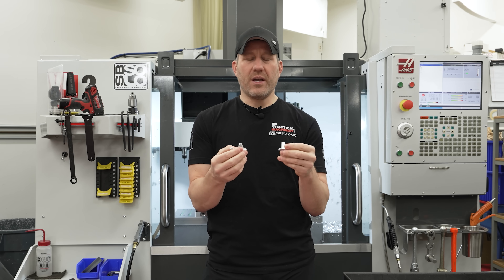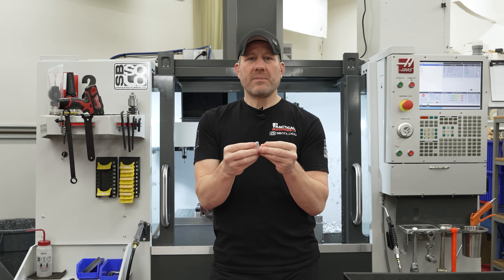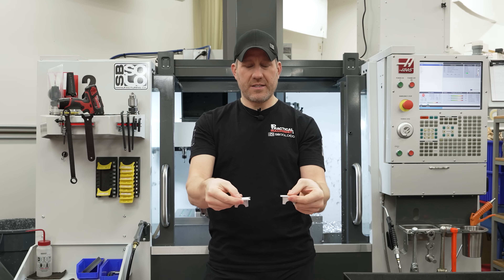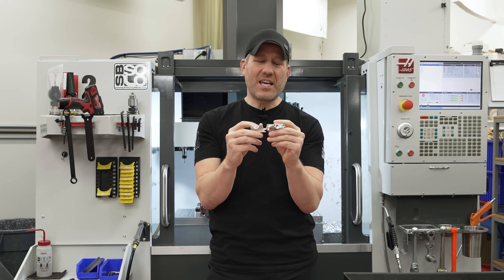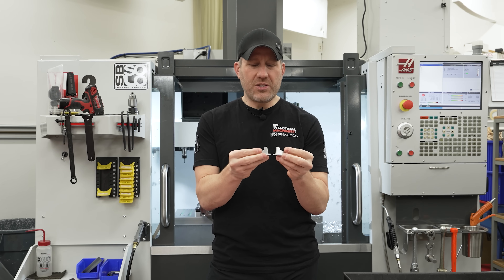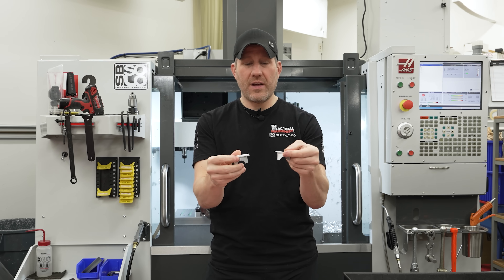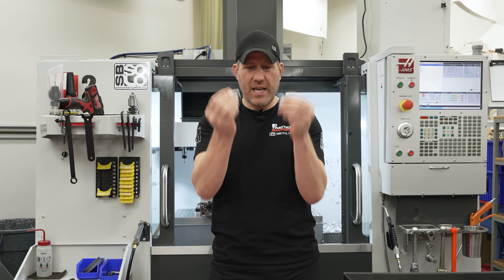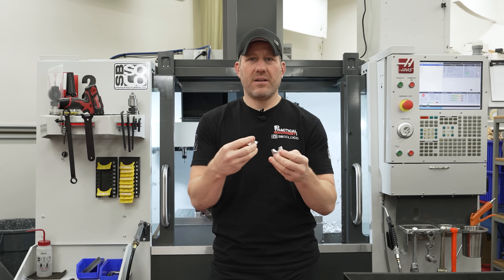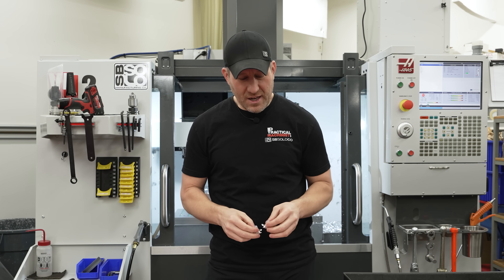This is a big thing I started doing: if you have a big piece of metal that's pretty tall and you cut your part out in between, it's going to bow on you and put a lot of stress in your part. Before, I wasn't even cutting a center piece out — I would just put it in the vice. The problem was the carrier was so thick I couldn't snap it down. I had to keep hitting and clamping repeatedly because there was so much tension in that metal I just couldn't get it to sit flat. But after I cut out the center and spot face it to where I'd snap it — even without snapping it, just putting it in the vice — when I tap it, there's no metal there to hold that tension, so it just lays down flat. It was just a really good situation where that tabbing routine worked.